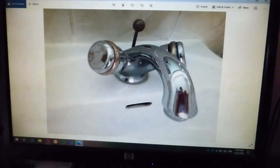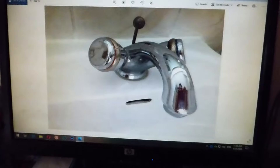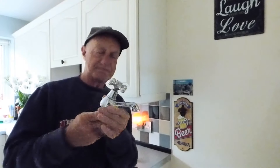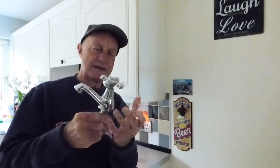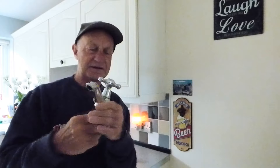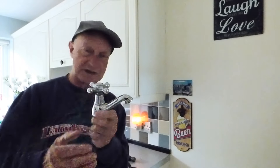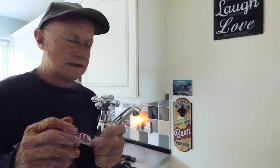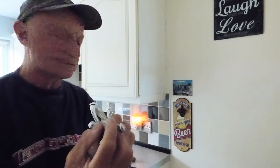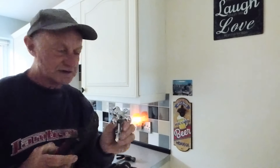We'll show you them and go through it now. The tap that I've got - which isn't these, but I'm just going to use it as a demonstration. Here we have just an ordinary little bib tap. It's the same sort of system inside - don't worry about mixers, the same kind of thing applies as regards getting the tops off. On this particular one, this one has a screw, and even this part here has got to come off. So you need a good tool for that, one that doesn't slip like pliers - they're no good, won't go wide enough.